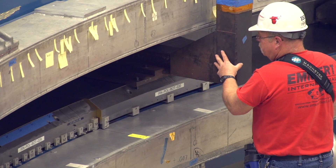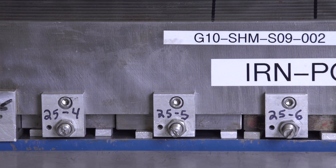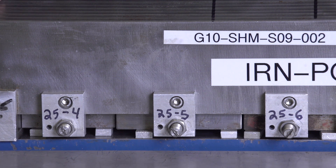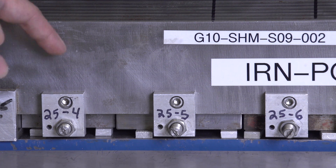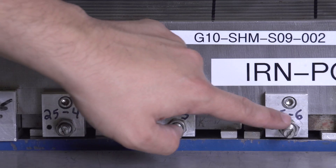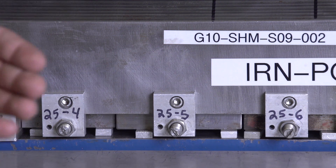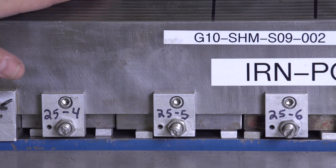We use the geometry information to determine how we should adjust the spacers between the pole and the yoke pieces, and then once the poles are nicely shaped we try to do some fine-tuning by adjusting some wedge shims that live between the pole and the yoke. You can see each of these screws here — turning them sets the position of a big hunk of steel that lives underneath this piece.